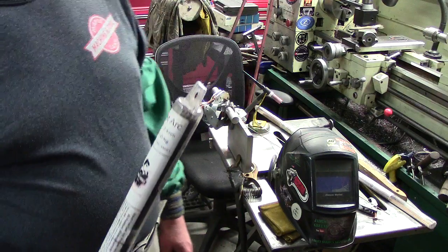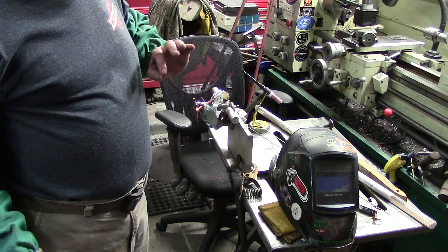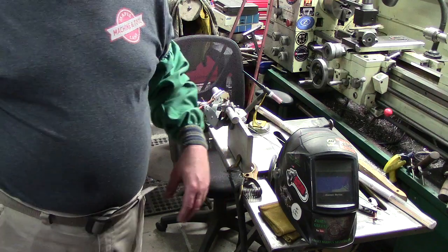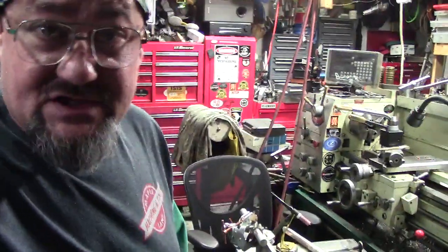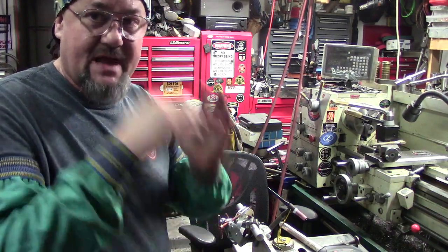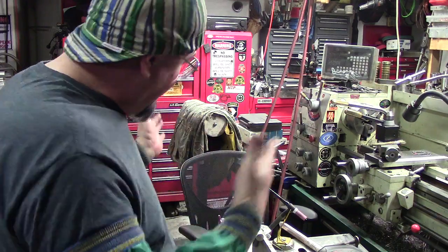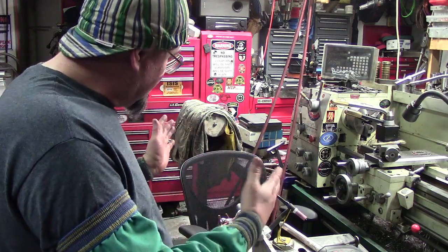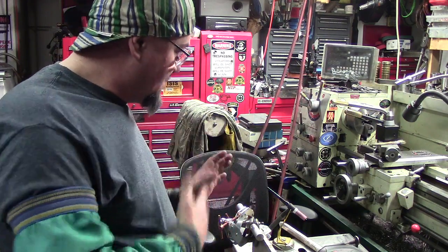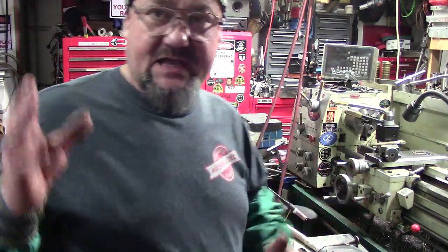I hadn't used this brand a whole lot, so what I've done in the past is we've brazed, which we're going to do. What I should have done is what I'm going to show you now. We were busy visiting and talking, and instead of paying attention to what I should have been doing, it caused a comeback, not a big deal. So we're going to preheat. I V'd it out, got rid of the old, so the chrome's removed, got rid of the old nickel rod that was in there, and we're going to go back, preheat, and use silicon bronze, 3/32 and TIG.